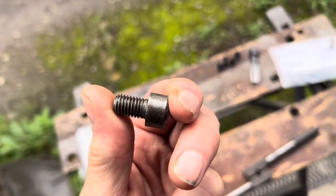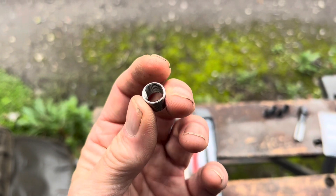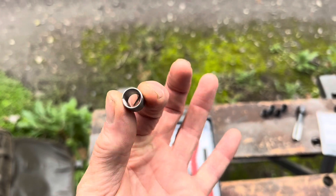You're also going to need a helicoil that actually fits your thread size. For example, the bolt that we're repairing is an M10 1.5 thread. This is the most common form of repair, and this is how our water pump housing was repaired by the machine shop using helicoils.